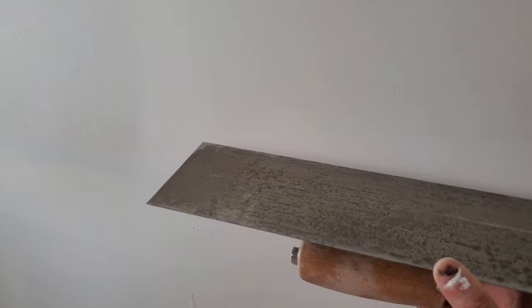I've done a little bit of sanding, and while I was in here, I was trying to figure out how do I know when I've done a good job, how do I know when to stop, basically, and how do I know if what I've done is any better than what somebody else did. What's the test, the metric? I realized that throughout the videos I was watching of the pros, what they would do is they would take a knife or a trowel or whatever, and they'd place it up against the wall, and they would look for gaps. Where there are no gaps, there's nothing to do.